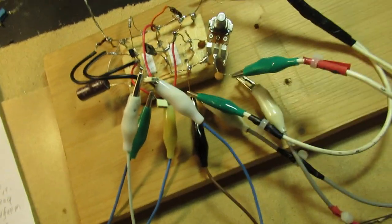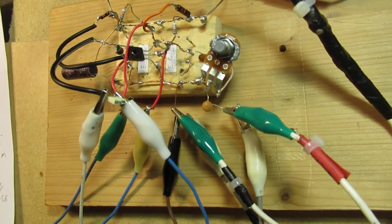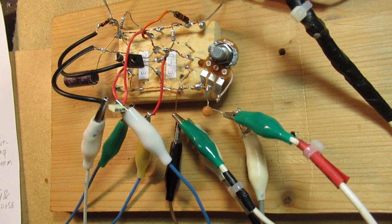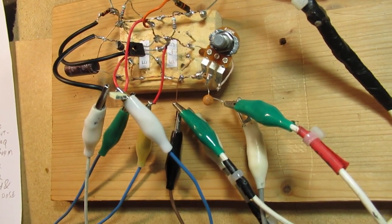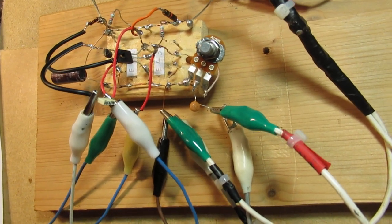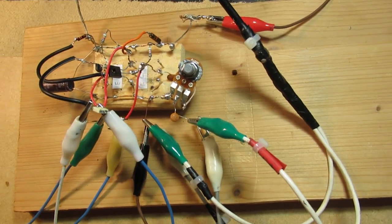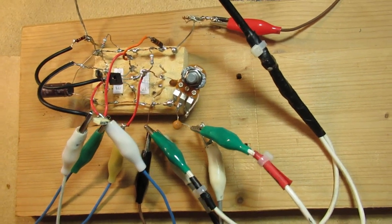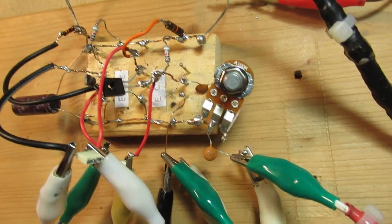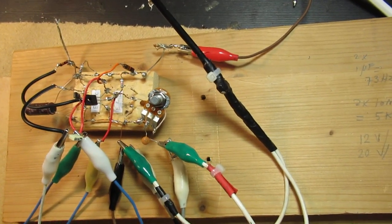And the good thing is that the circuit always oscillates with all kinds of capacitors between, say, 4N7, that is 4700 picofarad, and 1.5 microfarad. And that's an important thing. Often these circuits, perhaps on the World Wide Web, I don't know that exactly, don't want to oscillate on different frequencies.